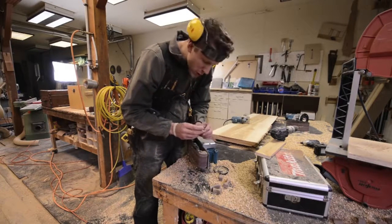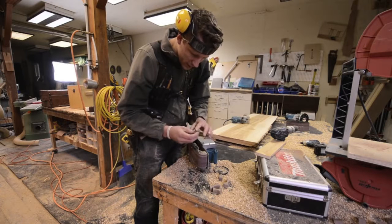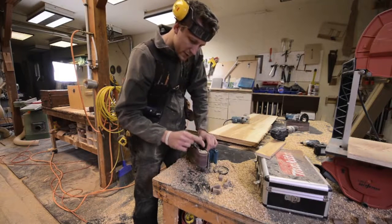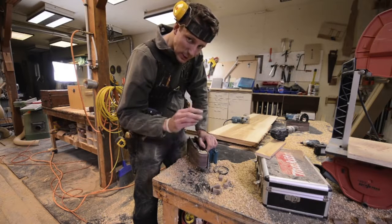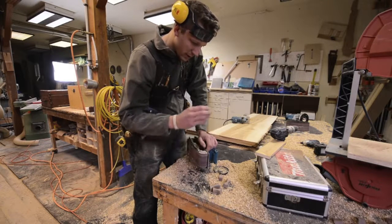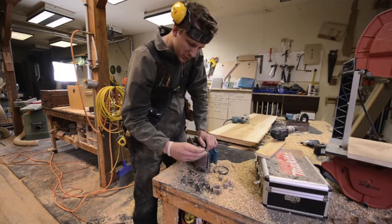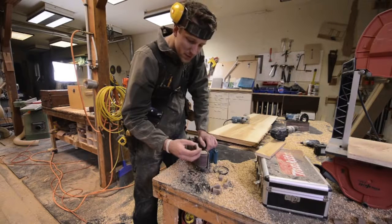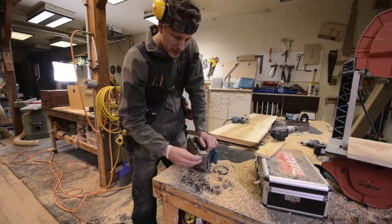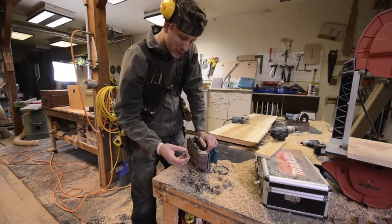Here's a little tip for you: just put a slight taper on it. Pick which side is going to be the upside of your dovetail, and then just taper your edges a tiny bit down. That way when you pound the dovetail in, it gets tighter and tighter as it gets flusher and flusher. You don't have to have your edges pared perfectly straight down because there's a bit of a taper — it's just going to wedge itself in there. Once it's wedged super tight, even if it hasn't bottomed out in the slot, it doesn't matter. Just sand it off flush and it looks great. Not even a sixteenth of an inch taper — just a little bit. That's how you get super tight bowties every time.